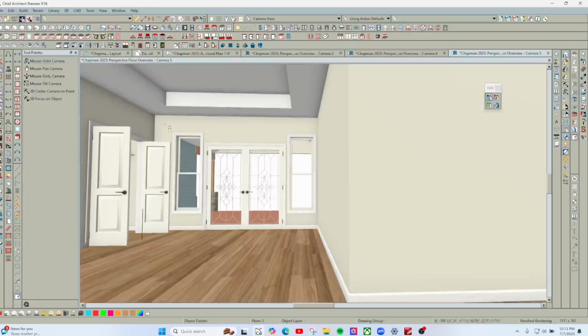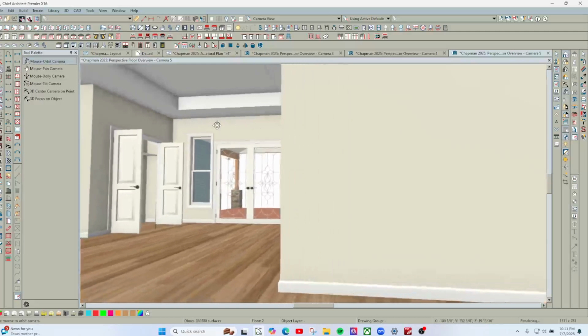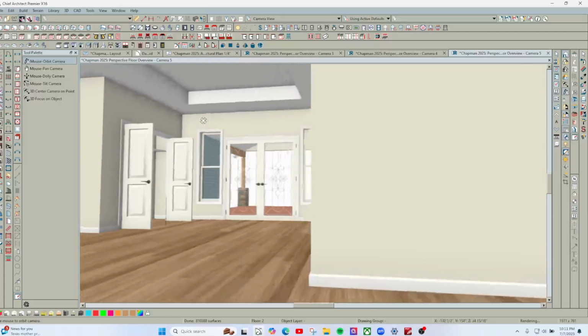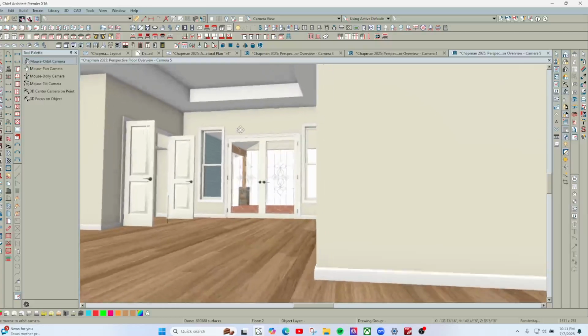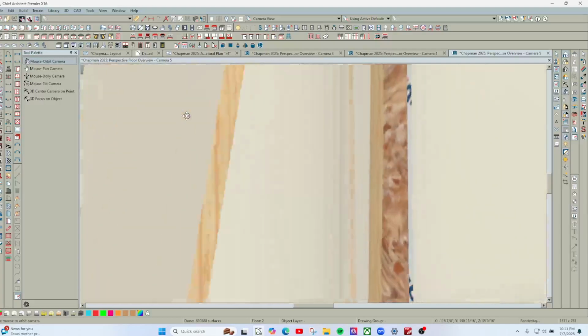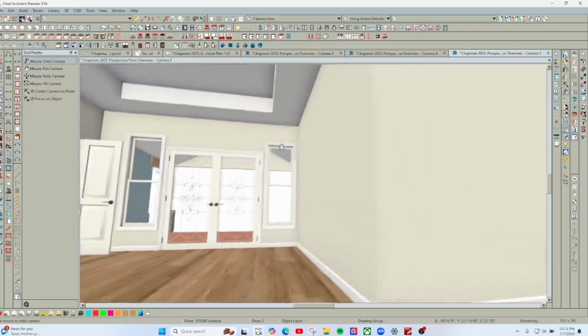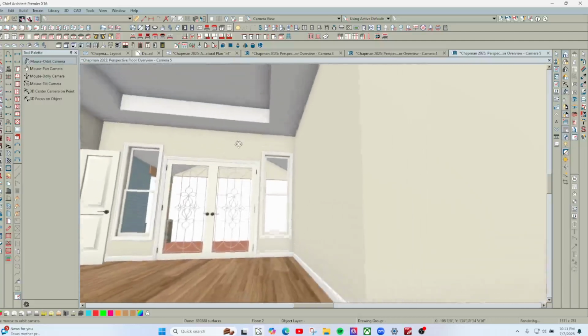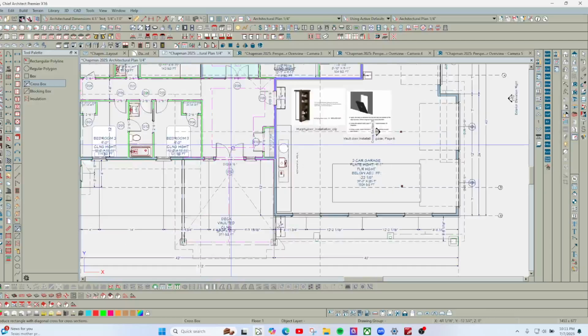A lot of guys will frame this wall here at 10 foot tall. Then they bring the truss in and they just land on a 10-foot wall, 1 foot higher than the other, so they can get rid of all this boxy junk here. And it allows for a potential higher transom window in this section right here. Might put a 1 foot transom over that, raise these up, and that would be shown. I did something like this, it'll show you.